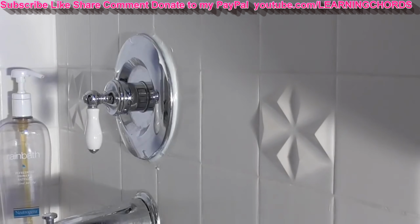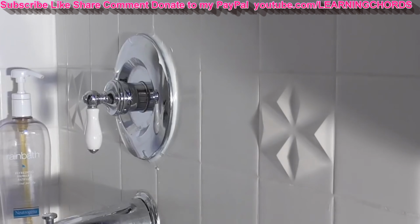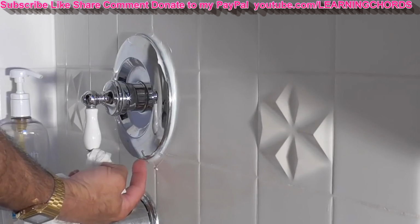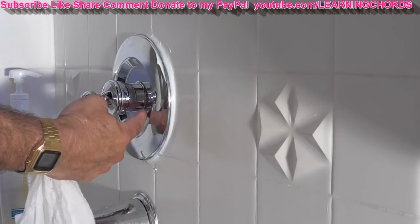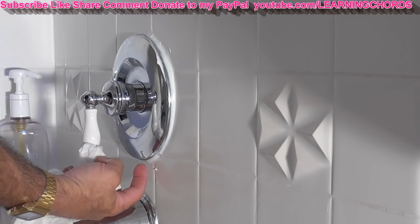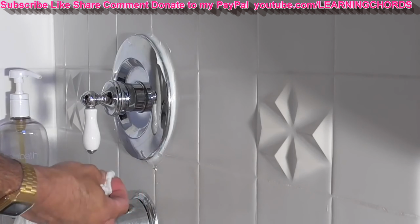So you can wait till this dries, or you can. I don't like to put sealer all the way down on the bottom, because if there's a leak, you want it to be able to at least run out of here. If you've got this completely sealed, there might not be any room for the water to come out.